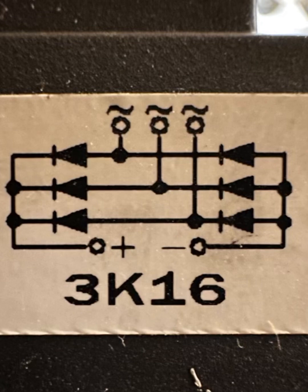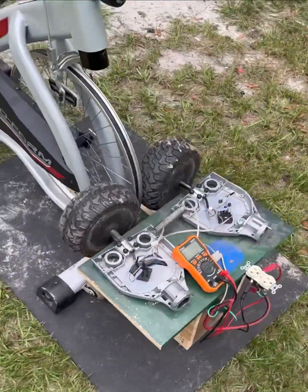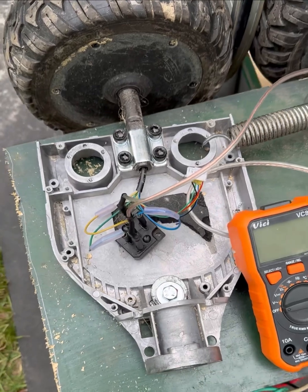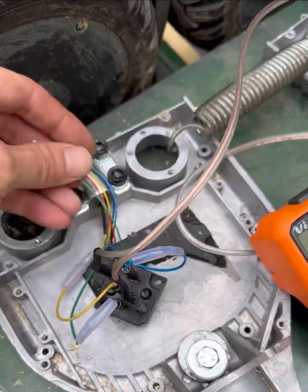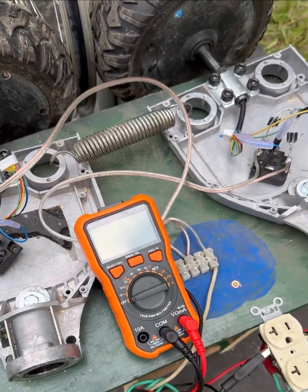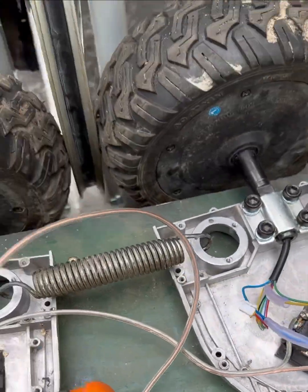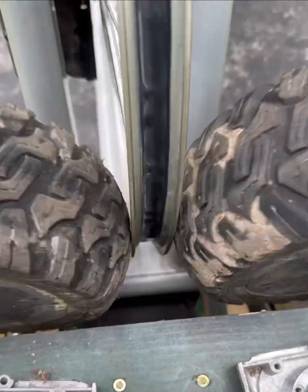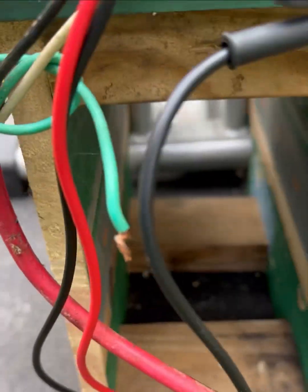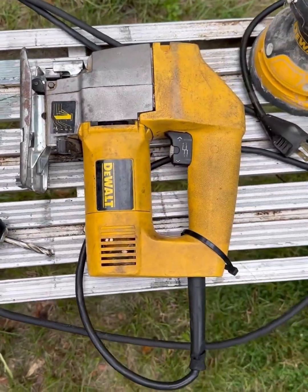This is the schematic — I needed two rectifiers because of the two wheels; they're both three-phase. In this setup I ended up putting the rectifiers in series to double the voltage. This is the Hall effect sensor plug, which you don't need. The other rectifier was a single-phase, so I added a phase to make it three-phase, and I ended up just wiring it right to a plug — no capacitors, no nothing — just to run off the mains of the rectified DC.